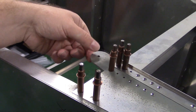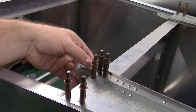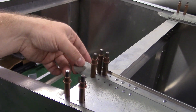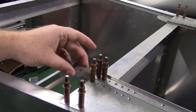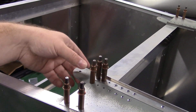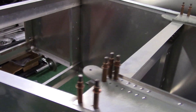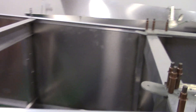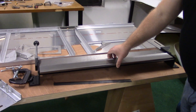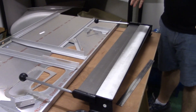This particular piece is a very thick piece of 6061 T6 aluminum and they had you bend it upward just a slight amount so that when you put your bolt in holding the upper part of the shoulder harness, it will sit properly and not bump into anything else. I had to bend it about five degrees and I brought my bending brake out. I'll go ahead and show a little video of what I did for the bending brake so you can see what I did earlier.